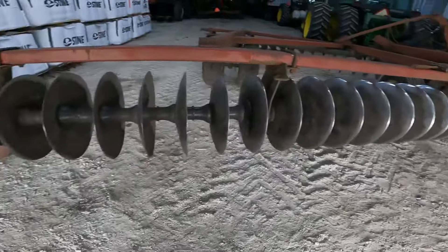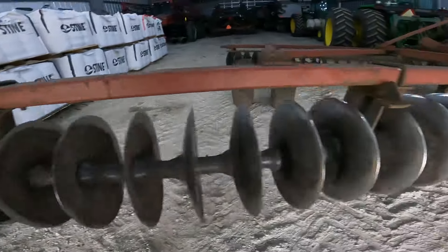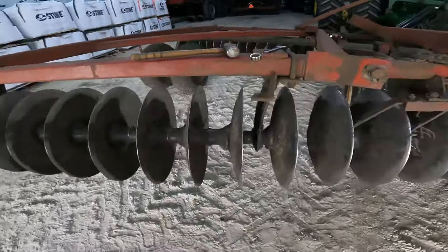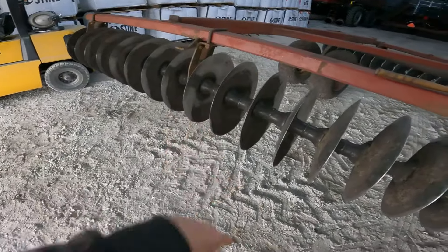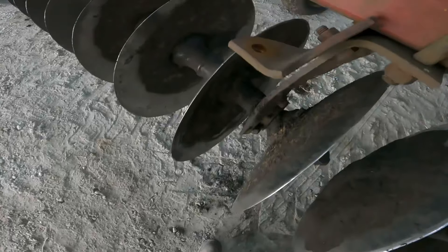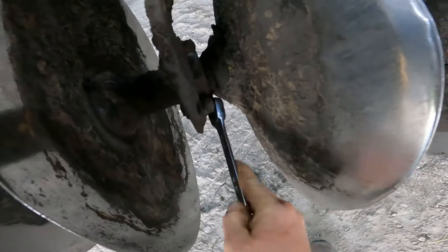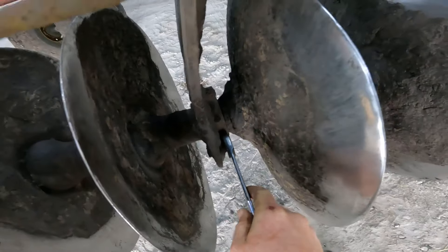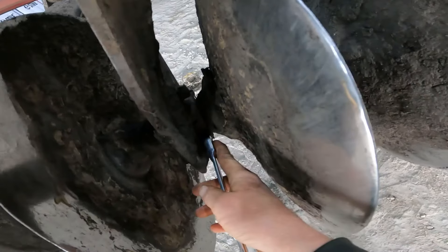To replace this piece, the whole back gang has to come off the wing. There are actually three bearings — to take these gangs off, you've got three bearings across here, and each bearing is held on by three half-inch bolts.